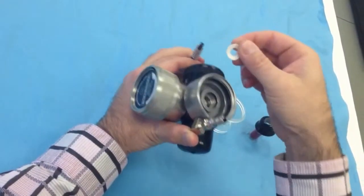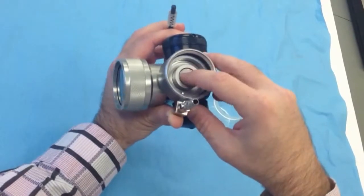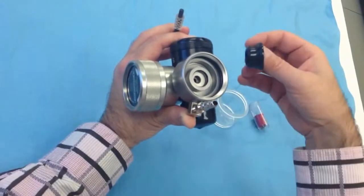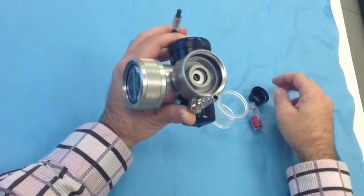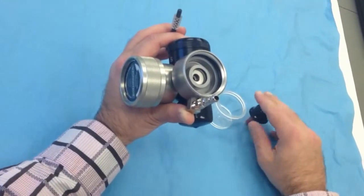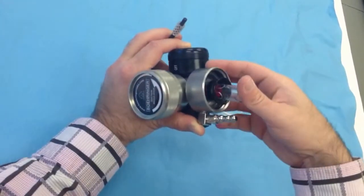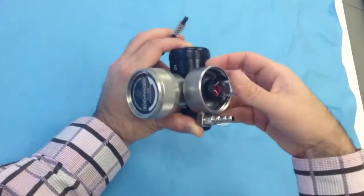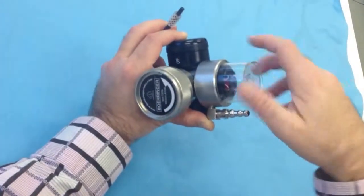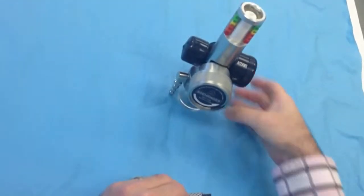Now this white part here is a gasket that helps the sealing of this. We want to reinsert this back inside. And then the next thing we want to do is reinstall our parts. So the shroud lays over the clear tube. And then this just presses on top of here. And just push it in. You'll hear that O-ring snap fit in. Screw the bottle back on. Just hand tight. And now we've assembled a trap bottle in this unit.